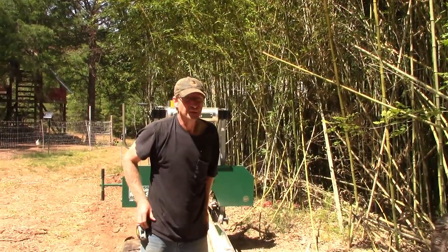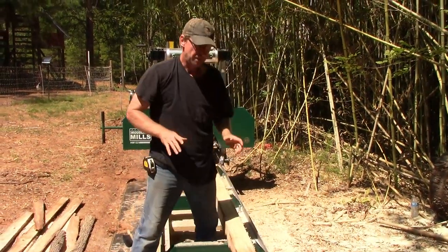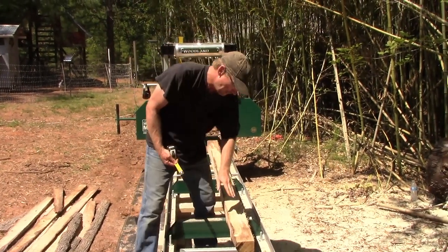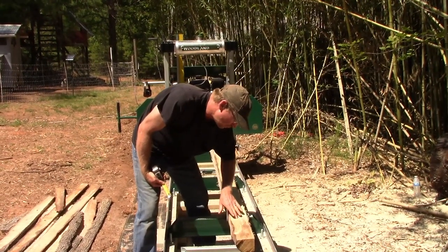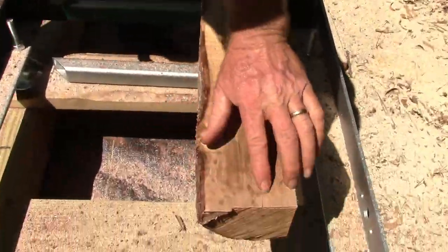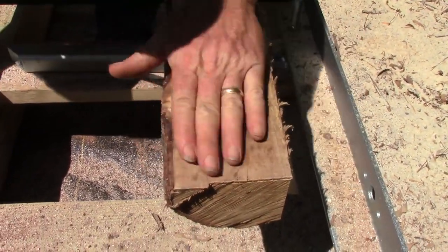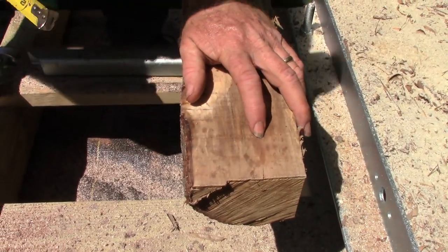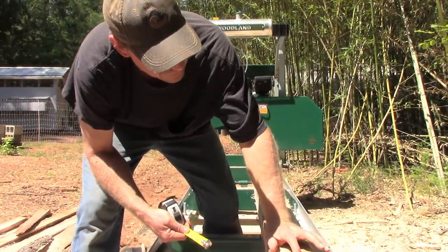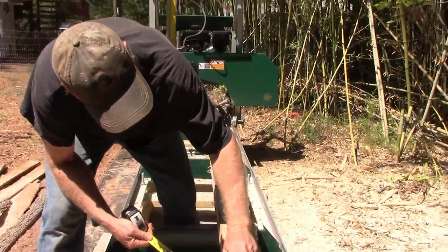All right, I'll stop boring y'all because I'm just having way too much fun playing. But I wanted to see how thin I could do this even with that messed up blade. Like I said, you get those little striations in it because I've got those messed up teeth, so you can see all those little lines, and that's where those dull teeth keep passing by. That whole blade is like 125 inches around. So within 125 inches, it makes it back around and it only goes that far until it hits the next dull spot.